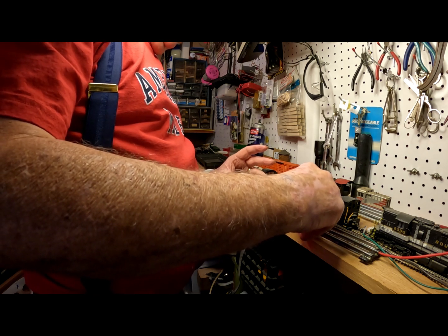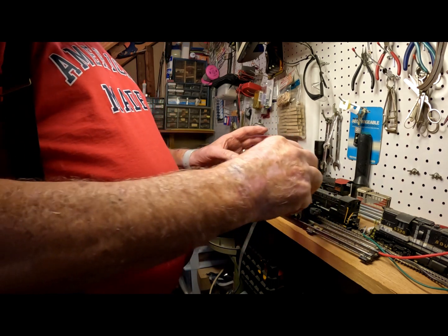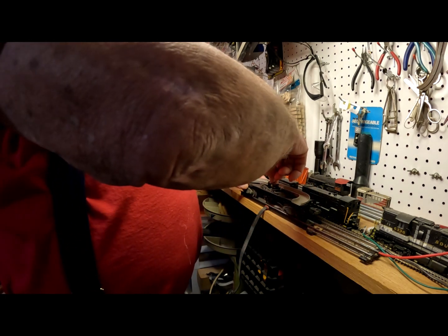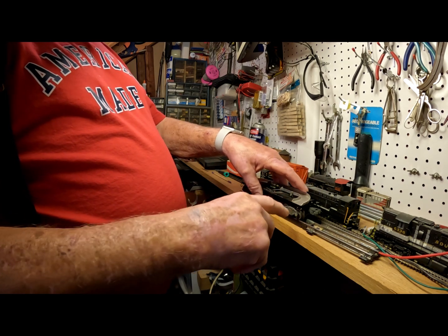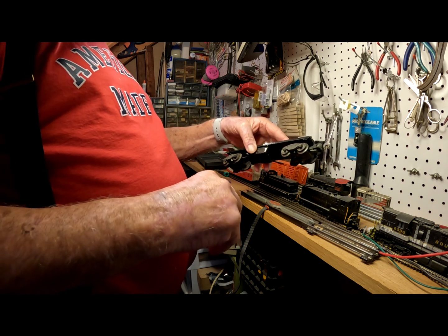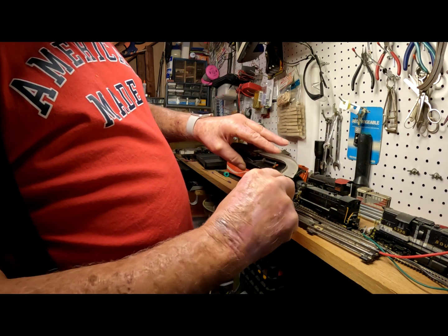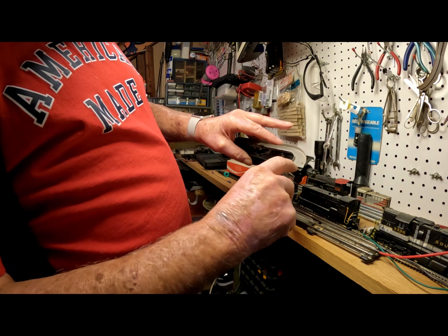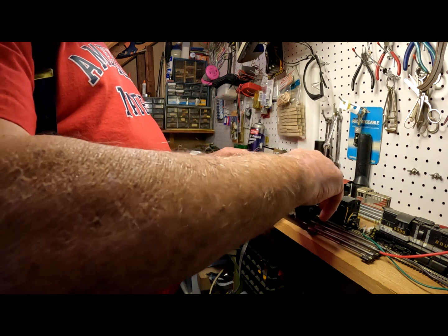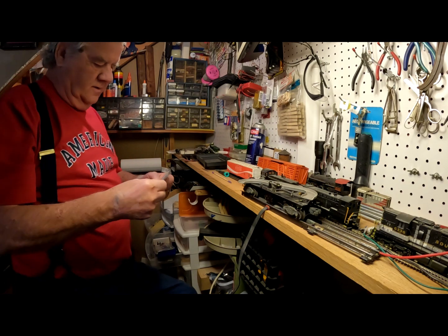Now, to get this to operate at its best performance, it has to be perfectly lined up, so the plunger is free to move and the gates don't restrict the doors, or the ends, I mean, of the channel. They put little holes in there that should line up accordingly with, of course that hole will be covered, but with the center of this pad that we're about to put in. So let's get one of those.